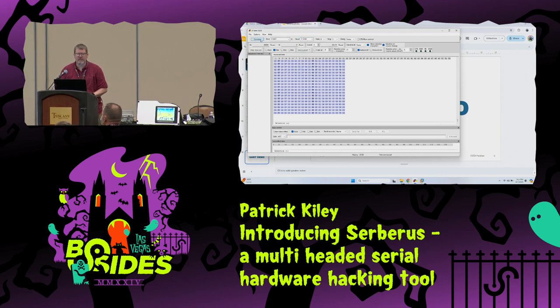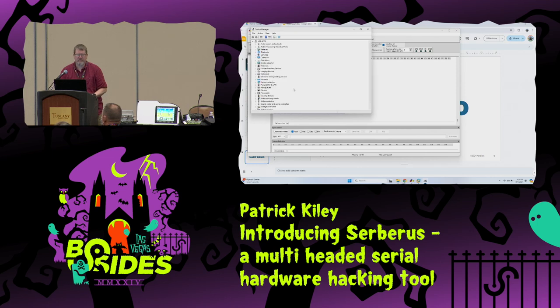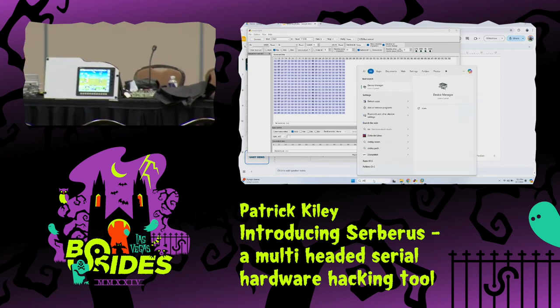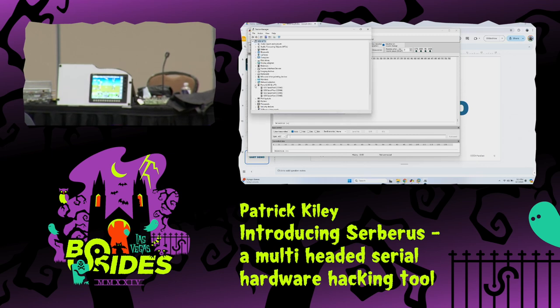So I don't like to use PuTTY. Okay, let me make sure I have this correctly selected. Yeah, COM3. So when you connect it up, let me bring that back up because it's a good thing to show. It'll show up as four separate USB to serial ports in your machine. On a Linux machine, it'll be /dev/ttyUSB. I like this particular application for what you'll see in a little bit when I do the avionics demo, but you can see it showing up as COM 3, 4, 5, and 6.